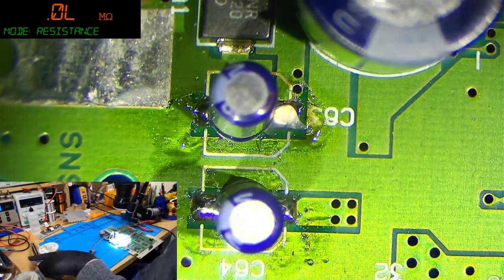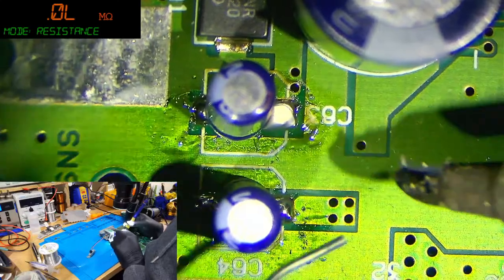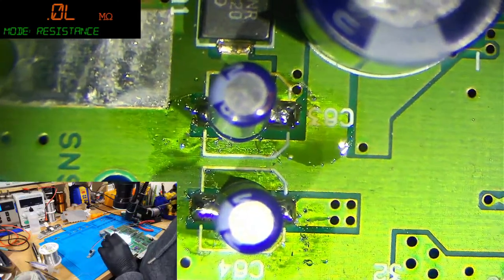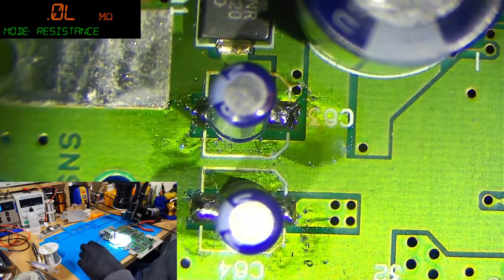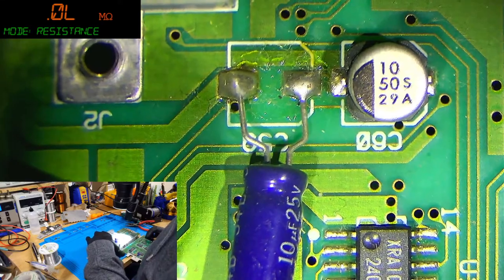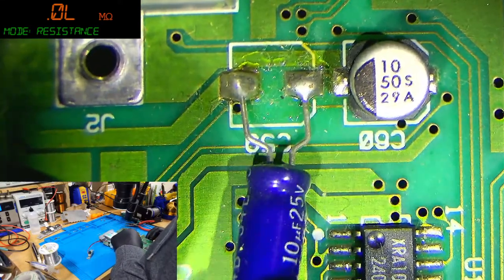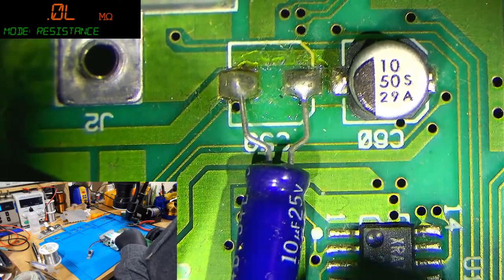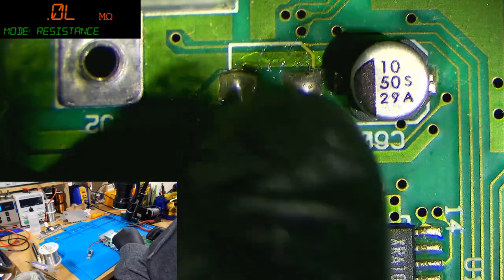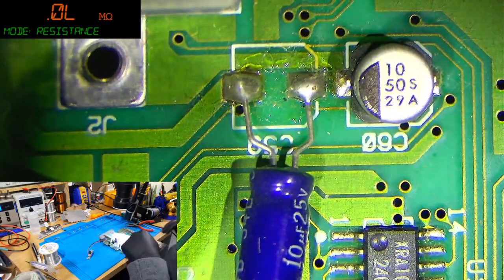And look, we've got the board's only through-hole cap. And what's interesting is we've also got a non-polarized cap nearby. I don't think we can see it on the camera yet, but I'll show you. And this non-polarized cap right here was actually done, I believe, after a recall on the initial SNESes, and you'll notice it's a different type of cap. This is like the ones I'm soldering on now, but they switched them out for non-polarized ones, and you can see there's no stripe on this cap. This was a common thing the factories did.